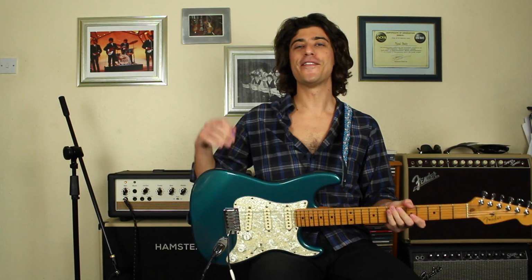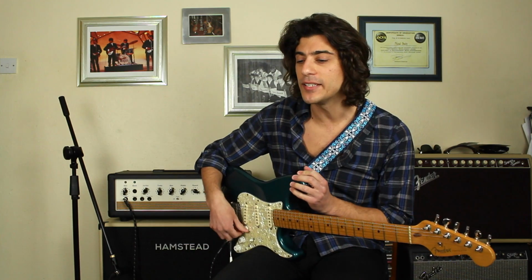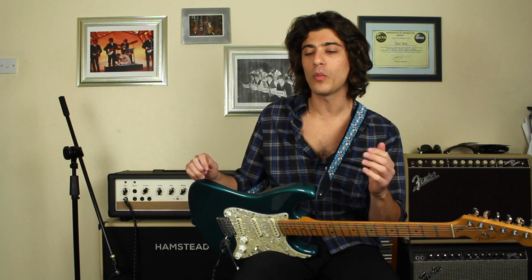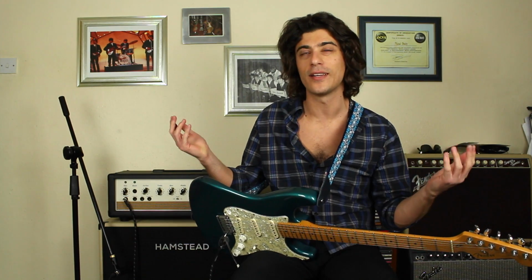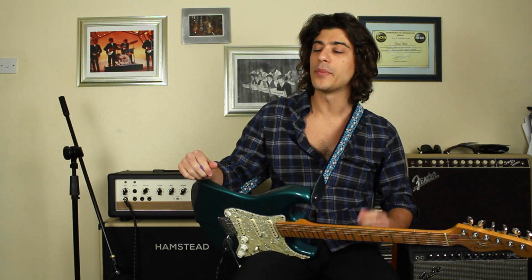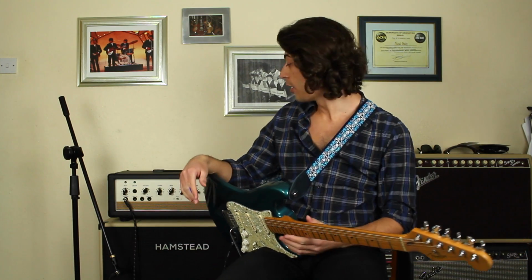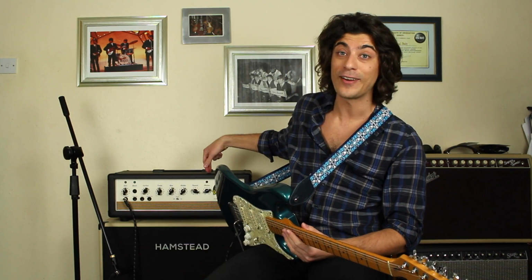So whatever all that gibberish was, you know what I mean? It feels like a valve amp. And like I say, it is a valve amp, but that power amp is solid state. Where a lot of people go wrong with a full-on valve amp, they smash up the gain to God knows what, and then have the master really low, and you get that really fizzy kind of sound. But by cranking the power amp and having the preamp low, that's where you're going to get your cool rock sound.